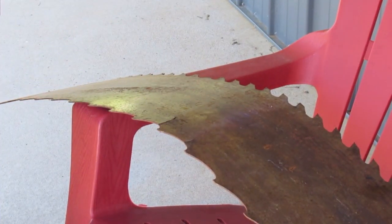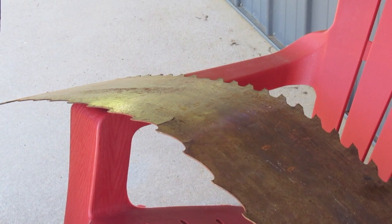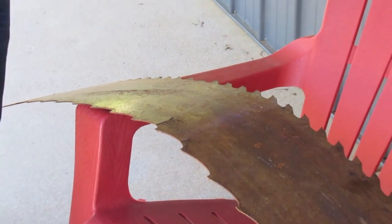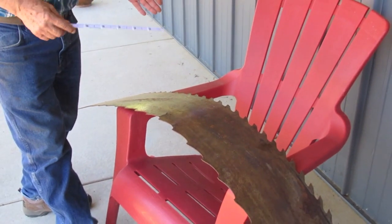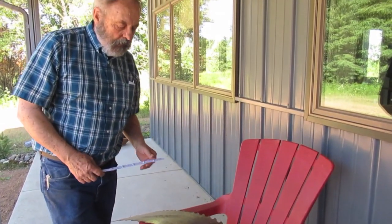Think about cuts where the saw is not all the way through the log yet — where you're still cutting some wane. You could see the back teeth really coming into play then. Exactly. Or if you had a branch that got partially sawed off and was stuck, the same thing would apply.